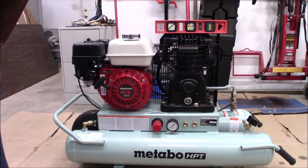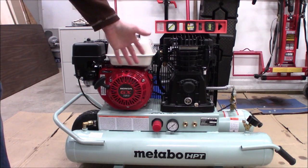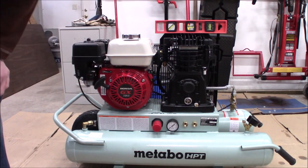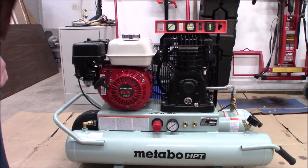This is probably going to be under full throttle load, so if we're not getting lubrication, we're going to get engine failure. The same general rules carry over to the compressor itself — it can end up oil-starved if you're on a steep incline. As level as possible — the manuals usually publish recommended maximums, which is somewhere around 5 degrees for these, and maybe around 15 degrees when you get to an engine that has an actual oil pump.